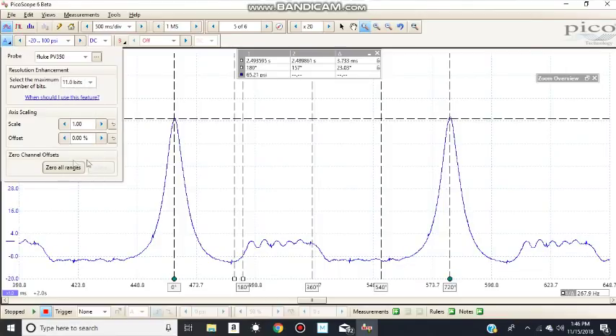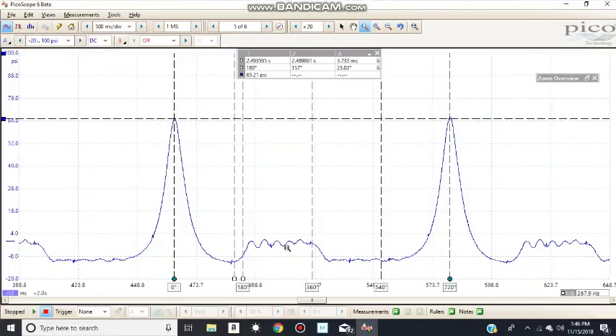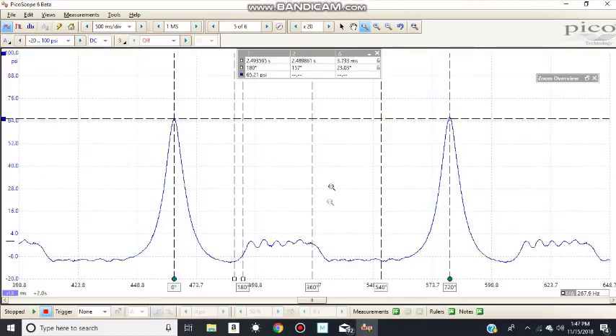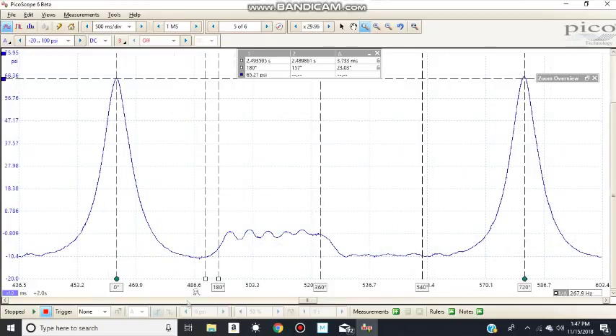You can add a little bit more filter, and this is a very usable waveform even on the 8-bit scope. On the Pico it's nice — you can actually filter a lot of the noise that comes from the transducer itself. You don't really lose a lot of detail — you can still see a lot on the waveform. That's pretty good actually.